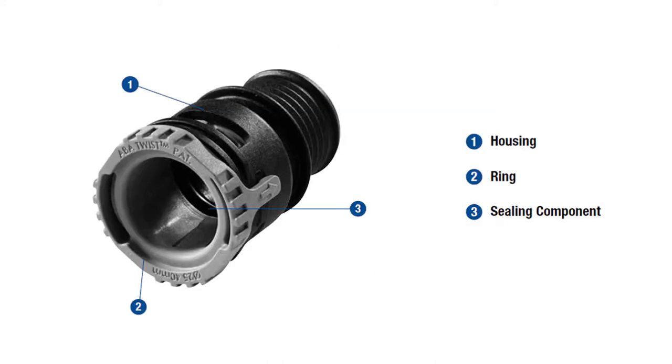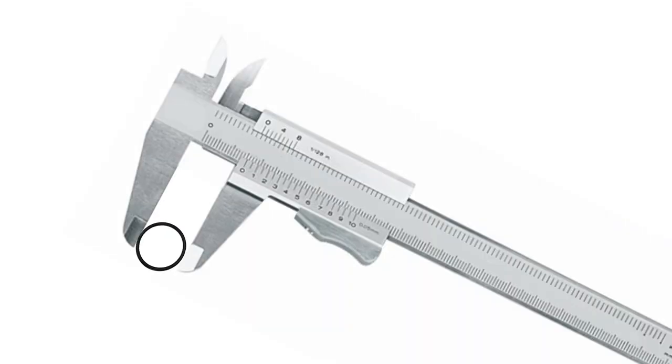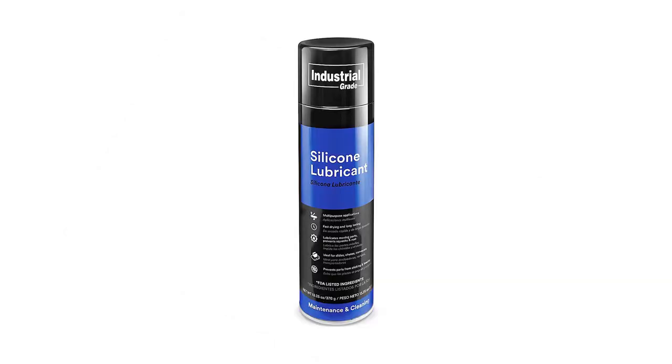It can be quite difficult to get the o-ring out so I suggest you use something similar to a dental pick or adapt a paper clip to hook it out. Measure the damaged o-ring precisely before seeking a replacement. When you put the new o-ring in place I recommend that you use some silicone grease to ease it into its groove.